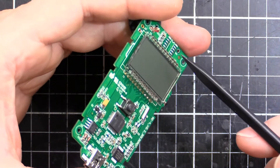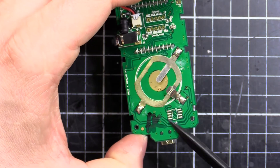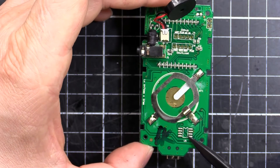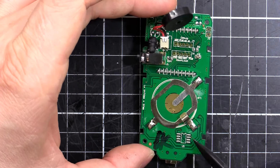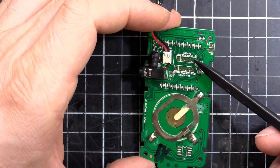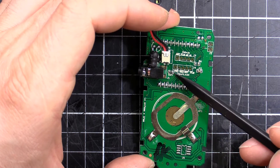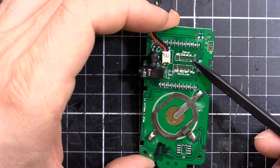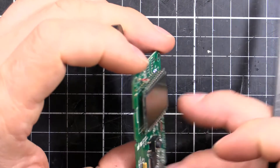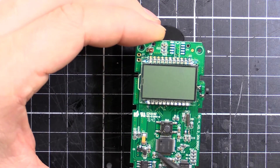Maybe if there's a humidity sensor chip, that unpopulated spot could be for another firmware chip or something. There are no markings except U5, so no idea what it would be. There are also two headers — one labeled debug and one labeled download — looks like JTAG headers, all nicely numbered out, so it's potentially quite hackable. And there's a little crystal and some jellybean parts around the place.